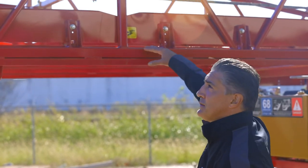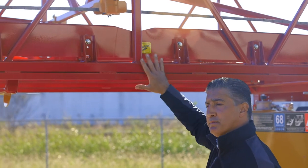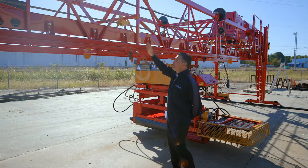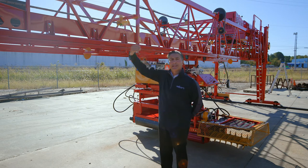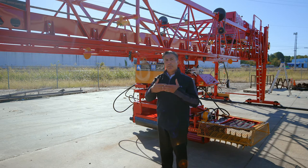This model behind me has a depth of frame of 36 inches. This model is meant to go to a 90-foot max width — you split apart the machine and add lengths to the frame in order to get to that. This can be put in a position for a flat roadway, a crowned roadway, or cross slope. So it has many different versatile functions for your paving surface.